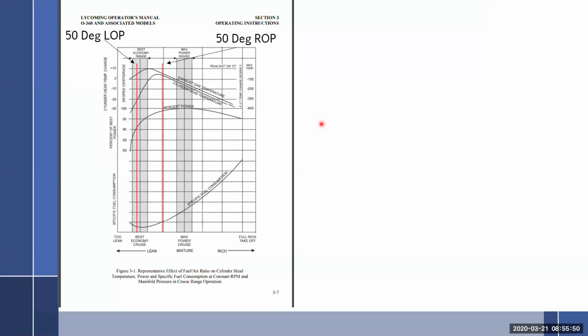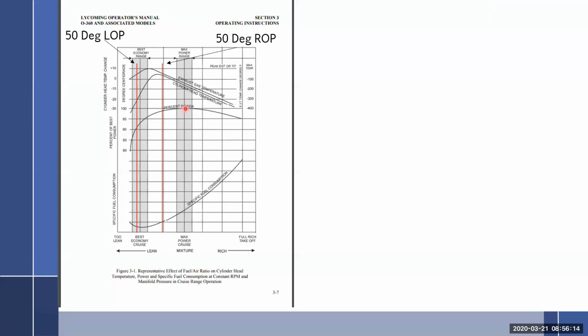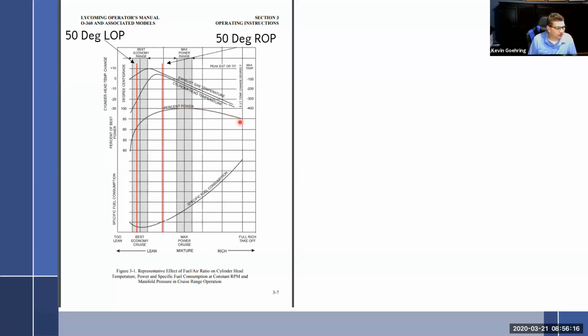Okay. So this entire chart is going to be set up, number one, so that you set the engine for 75% power. By that, I mean the throttle. You set the throttle for 75% power. Got it? Yep. Okay. If you lean it perfectly at that 75% power, you're going to be here. If you're enriching it, you're going to fall off to what was available in that power. And if you really lean it, it's going to go that way in power without touching the black knob.